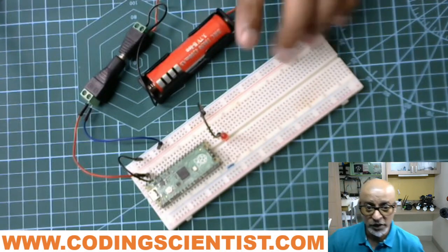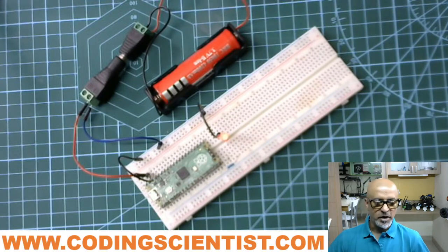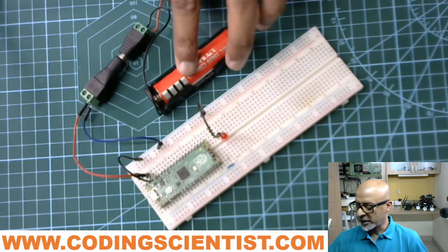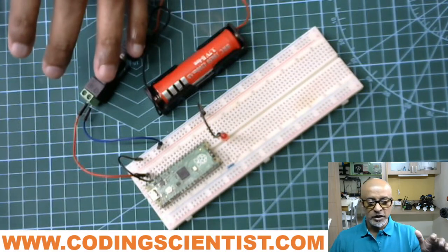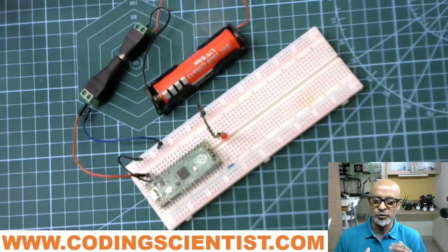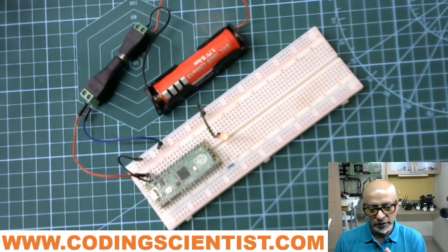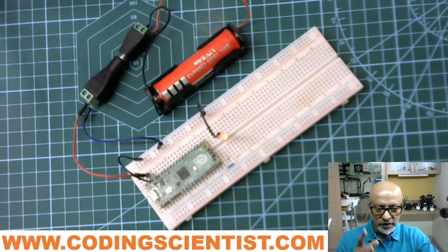We are going to do tons of exercises using the same setup with a 3.7 volt, 18650 rechargeable battery in the upcoming lessons. But when we get into the motor aspects, because we'll be connecting multiple other devices to drive the motors, we may need extra power. So I'm going to show you how to build that particular circuit.